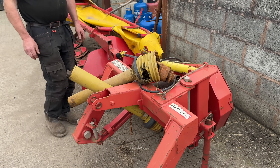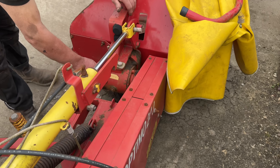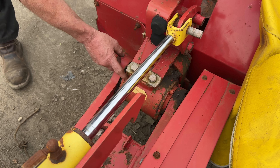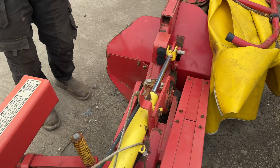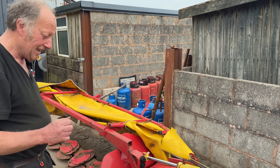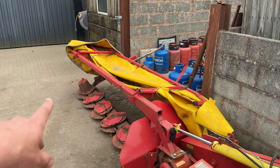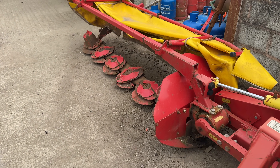You've got a belt drive down to a gearbox there, and you've got two sections of that gearbox. It's long but well serviced. But if you get moisture in there, it turns to rust and gunge, and that can be quite expensive. Mike's favourite word is detritus. So we could have got something on our hands here, because the way you have to undo these sections and bits and pieces is a bit of a pain.